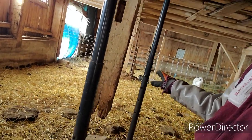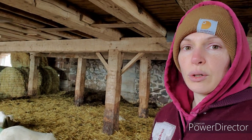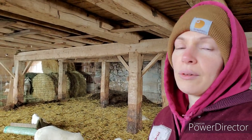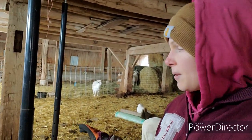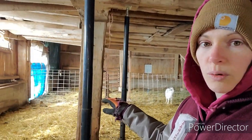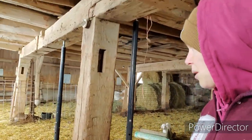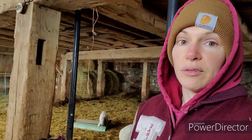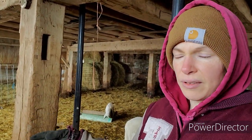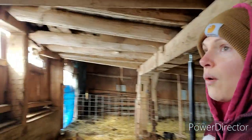This one column is probably the worst one that needs to be replaced, and there are others where the wood is starting to rot at the bottom. We have a crew coming in — I don't know if it'll be next month or maybe in March — and they are going to cut up high enough on the wood where it's still good. Then where the gaps are or where it's rotted, they're going to create a form underneath the column and fill that in with concrete.